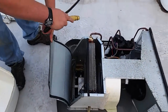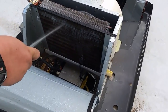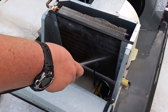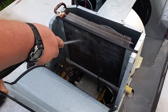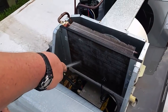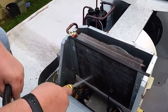You can see how dirty it is. As I start to hose it down, it's going to clean and silver out. It's already kind of yellow to start with. Now if you see this coil sitting in a plastic tub, that's your condensate catch — your condensate pan. It'll catch all the water coming off the coil, because during normal operation it will condensate. That's why your air conditioners drip water, and it comes out of the pan.